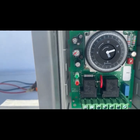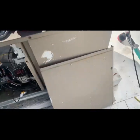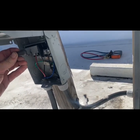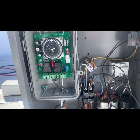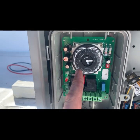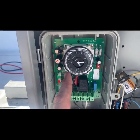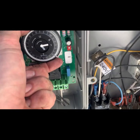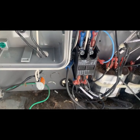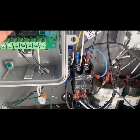We have green light. We have a slurping coil. So with these microchannels, they really don't like even a little bit of water — any bit you can help them with, go for it. When I flip this into defrost, all I'm going to do is dial that to a defrost, and the compressor and the fan should stop. But the contactor is still going to be pulled in, I think, because all I'm doing is interrupting the power feeding everything. Oh — no, it did kick out. So when we go into a defrost, that shuts down.